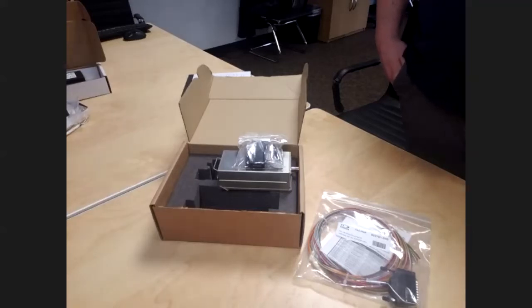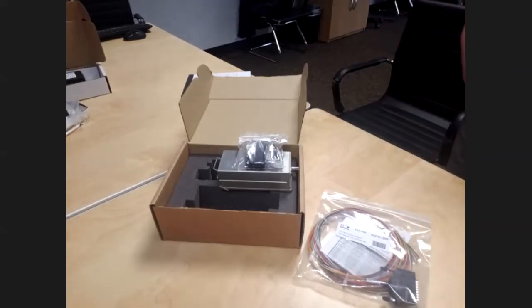And the transponder does double duty as your ADS-B out device. So it's a Mode S transponder with an extended squitter, which means that it's outputting ADS-B out information, including the GPS position and barometric altitude, to the ADS-B system. Again, that's here mostly for US customers. So it's kind of a two-in-one device.